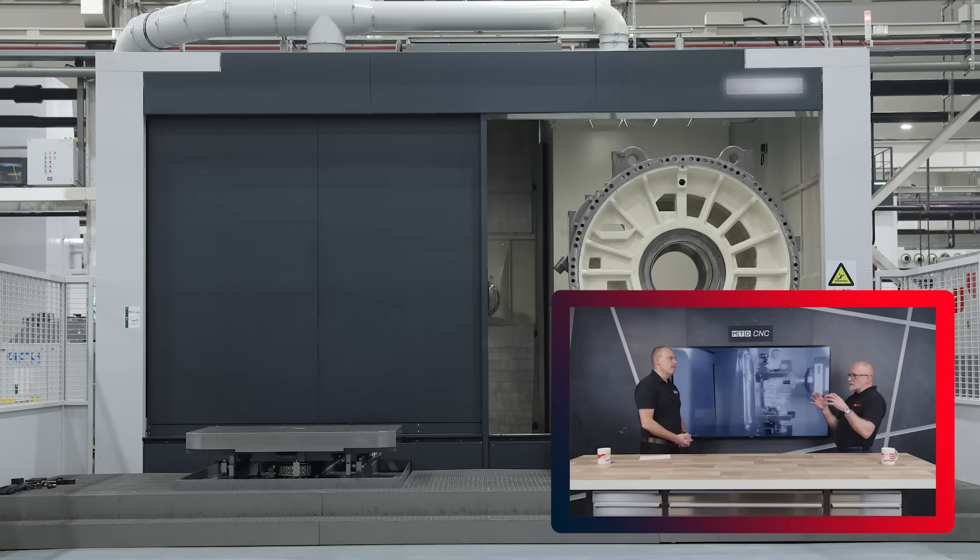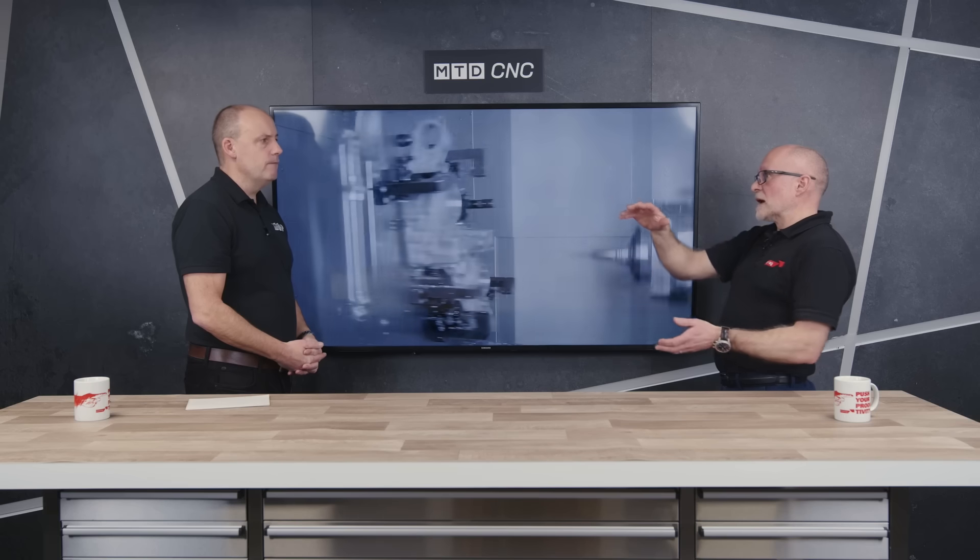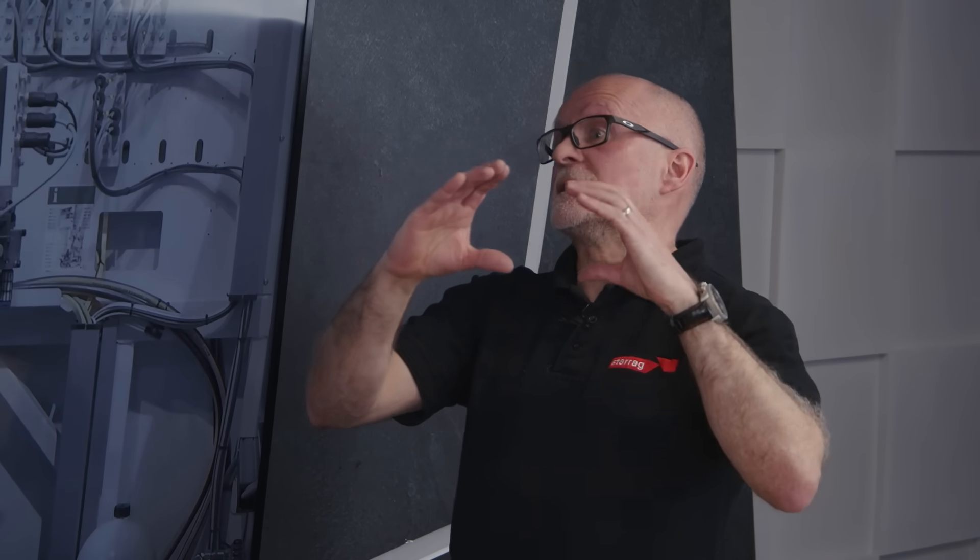If we take the components for the rail industry or the wind turbine industry, you've got quite a distance between some of these bores, and you've got temperature variations in the shop - sometimes temperature variations within your machine depending on your machining processes. So we take what is already a very accurate industry-level machine and take it to the next level by doing certain things within the machine. We gain an extra two, three, four microns per axis in some cases when we're looking at those bore positions.